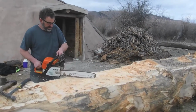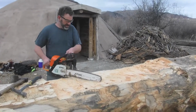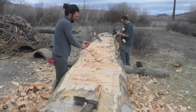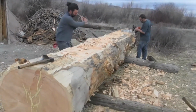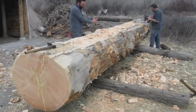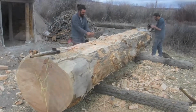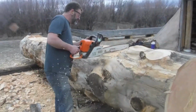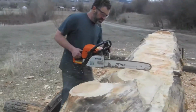The sawmill had marked one side as the top. Well, Churchill looked at it and decided that was probably going to be the bottom. And so that was really our first step, was to flatten out the bottom, while leaving the two ends undisturbed there in case we changed our mind and decided to make that the top after all. Then it was time to turn it over and work on the other side.